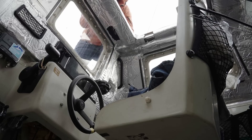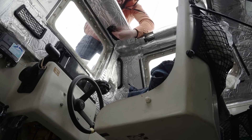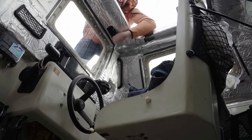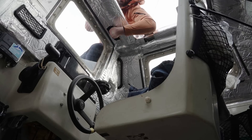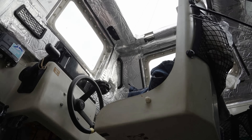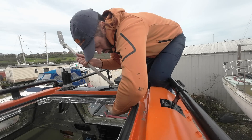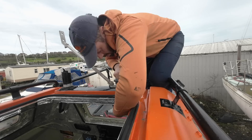We have large M12 bolts and a thick plate of drilled steel on the other side of the shell as a sort of custom-made giant washer. The fiberglass shell is strong, but spreading out the load seems like a friendly sort of thing to do. I used my favourite Bostik sealant, and ensured the bonding area was rubbed back and keyed so we get a good bond and seal. Sticking it to paint would be somewhat obtuse and self-defeating.